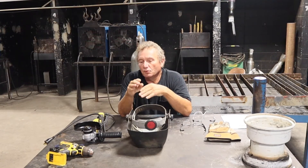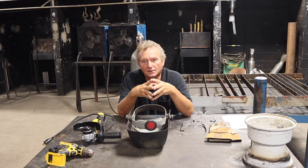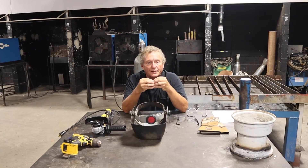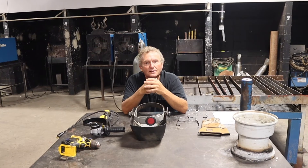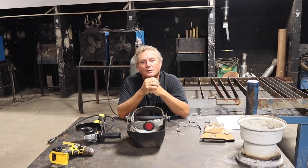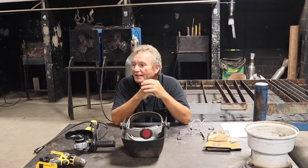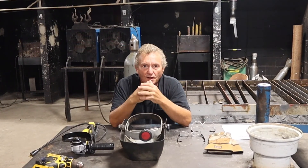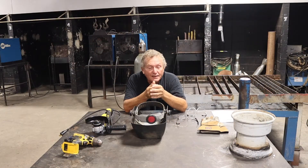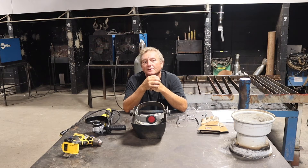Long sleeves — you do need to wear sleeves when you're arc welding because it puts out ultraviolet rays, same thing as the sun. If you are sensitive to that type of thing, if you sunburn easily, a welder will sunburn you big time if you don't cover up. Do you need to wear a long sleeve all day? No, you do not. Only when you're arc welding is it necessary to wear long sleeves. Long pants, of course. Boots are needed because they protect your feet from sparks. Metal can fall on the floor — that kind of thing. You have to dress pretty heavy when you weld.